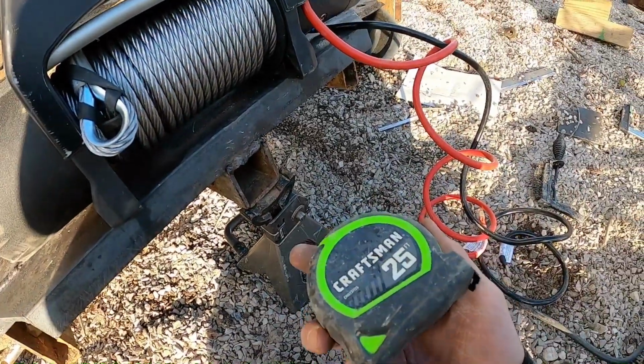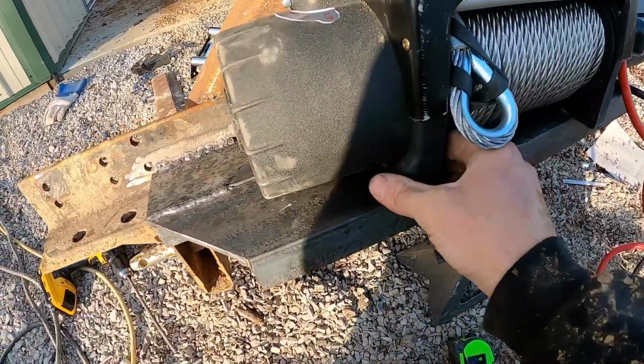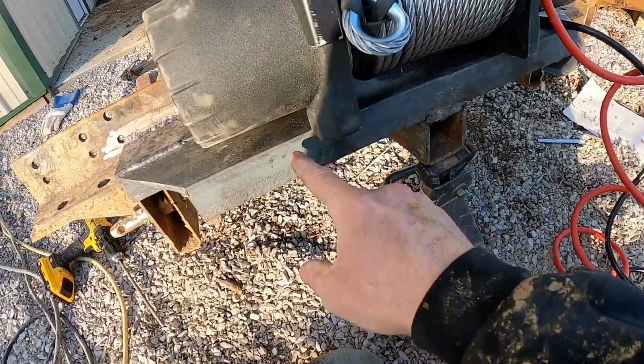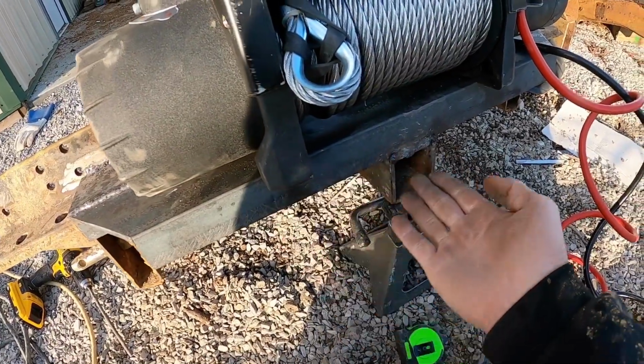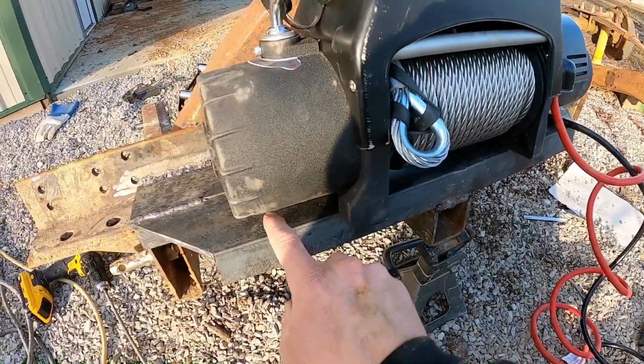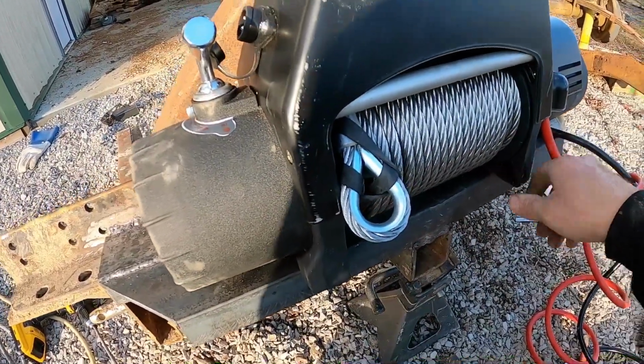Listen, I forgot some crucial measurements on the top clearance. I don't think it's too big of a deal. What I'll do is I'll just take a piece of angle and run it over and over, and it'll catch that bolt hole and that bolt hole, and I'll just have to drill one and two there and one and two there, and that should be fine.